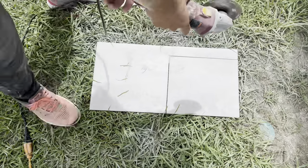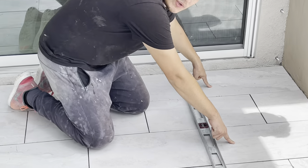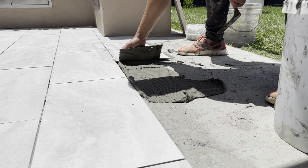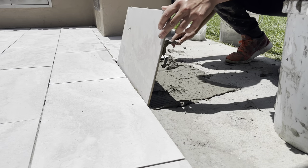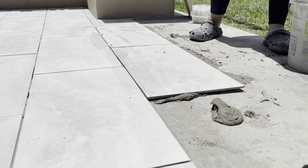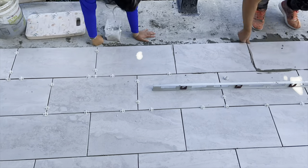To make sure all of our rows were symmetrical, we used a long level placed against the house so our lines stayed in the same spot even though they are one row apart. Here is another angle of installing the mortar: first, add mortar to the floor, then spread evenly using your trowel and create those grooves. Next, place the tile. If the tile is lower, lift it and add more mix. Check for leveling and clean any excess mix with a wet sponge. To clean between the tiles, use the spacers to push out excess mix — this is key for installing grout later. Wipe off excess mix, place your spacers, and repeat. Check for level every few tiles.